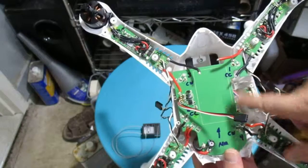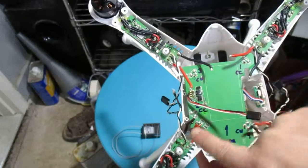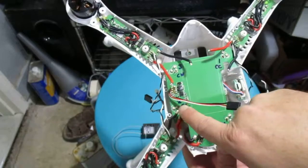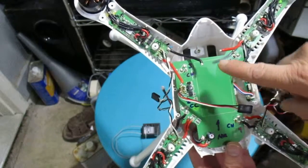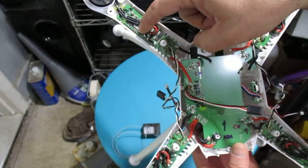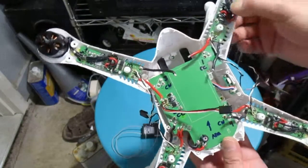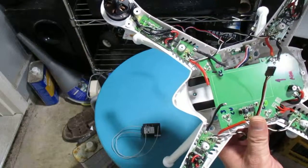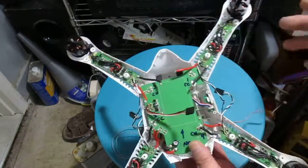To have clockwise rotation on this motor, I'd recommend writing this down so you don't get confused. With the APM it's motor one, two, three, and four — I put clockwise for these two and counterclockwise for these two. The red wire, if you aim the motor down, goes in the middle. Then the left and right wires follow. On this one, if the motor is facing down and you're looking at the three wires, they're just directly sorted straight across.